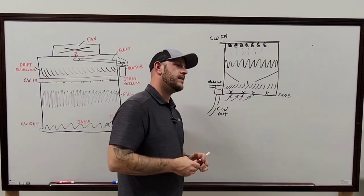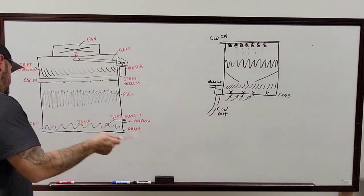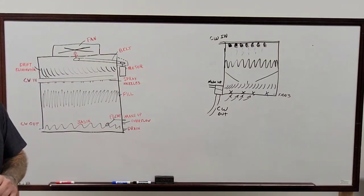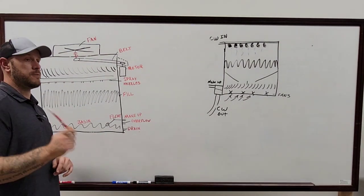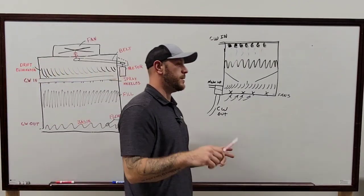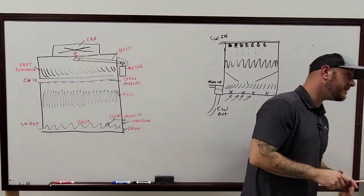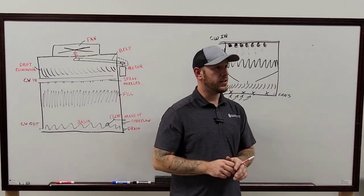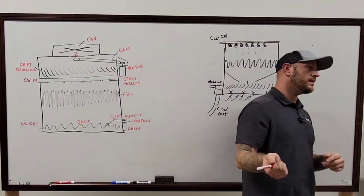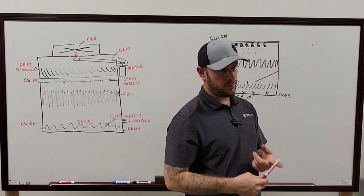Grease practices for cooling towers. Glad you brought that up. Any bearing that is going to get exposed to moisture needs to be what kind of grease? White. There you go. Why does it need to be white? It's moisture resistant. Exactly. It pushes the moisture out instead of absorbing it into the grease like blue grease does,